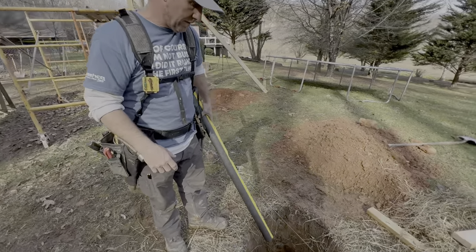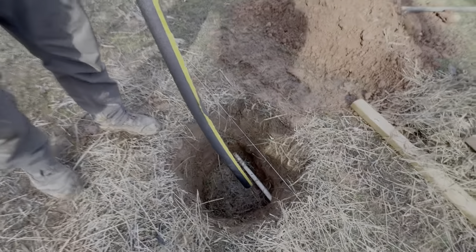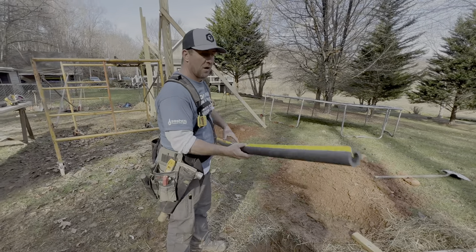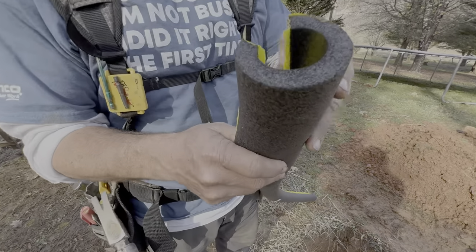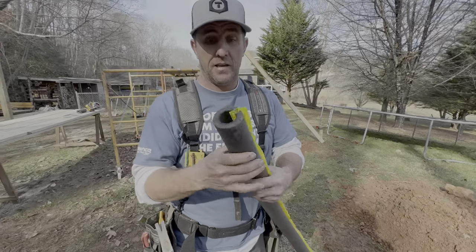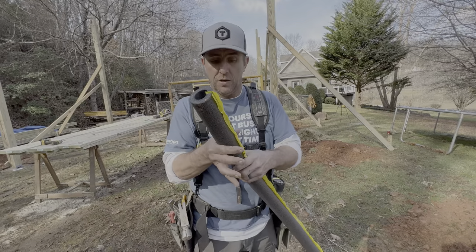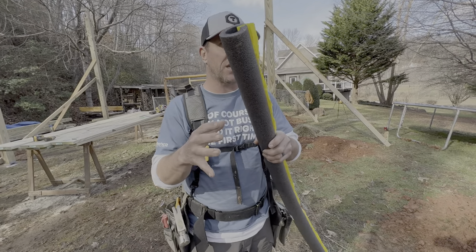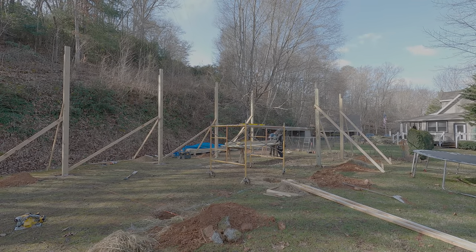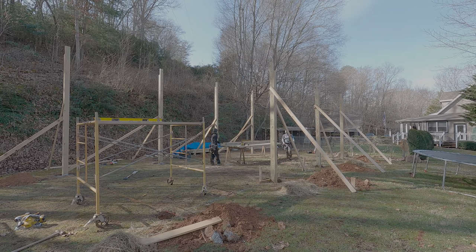One thing I wanted to mention — remember when we were digging these holes we ran into my water line. I've kept them covered with hay while waiting to pour concrete so it didn't freeze. What I did was buy this squishy foam stuff and wrap the pipe in it, so when the concrete goes around it the pipe has some room to expand and contract — if the concrete moves a little bit it's not going to break my water line. Jason added that to the two spots where the water line was exposed and we kept on doing the posts.